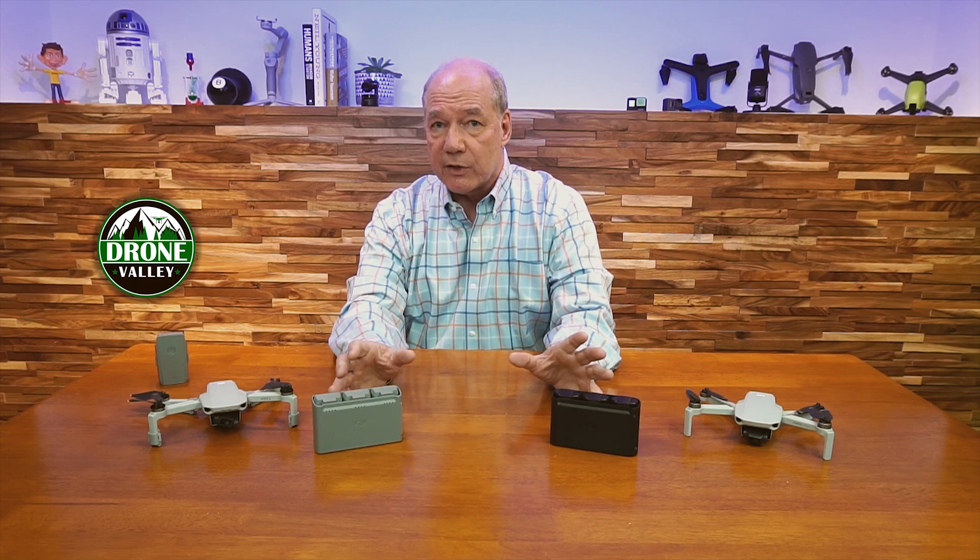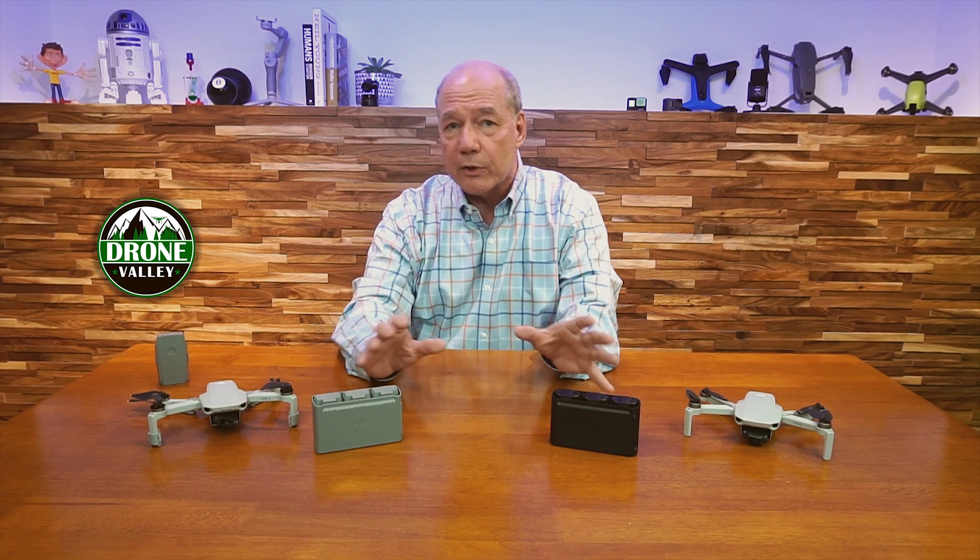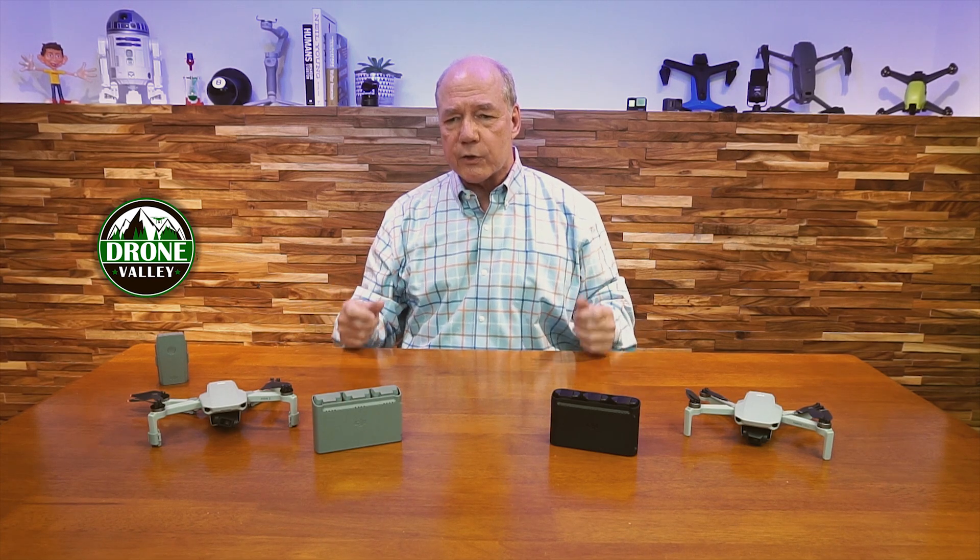There's a slight difference in the chemistry between lithium-ion and lithium polymer, but essentially they share the same bloodline from a chemistry perspective. Inside these batteries you've got a combination of chemistry that produces incredibly powerful batteries in a really small space — the Mini 2 battery alone is about 7.5 volts with 14 to 17 watt-hours of energy. They're incredibly dense and lightweight for the amount of energy they carry.